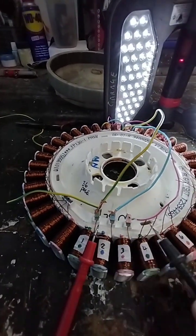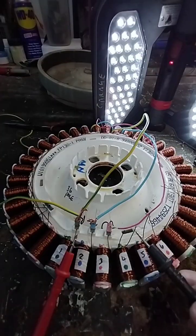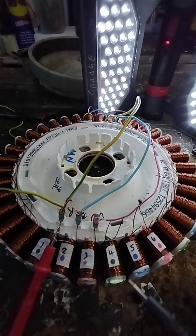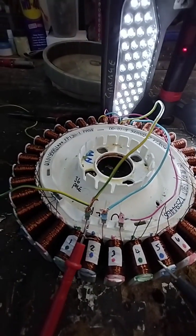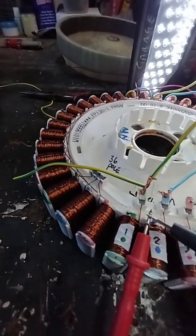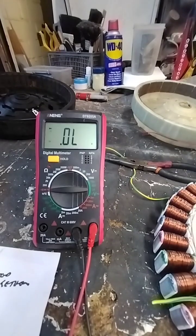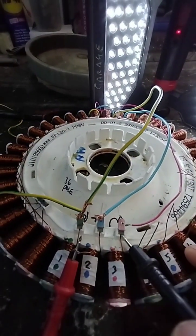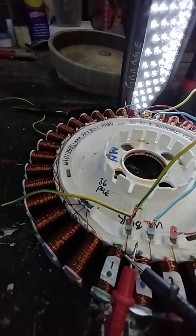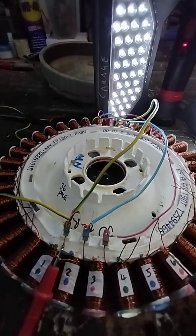The blue and the green confirm we've got a really good connection. You have to do that in all of the banks of three, because if any of these aren't joined together correctly you'll have a blank spot — that lot of three won't be doing anything. Make sure you do your continuity test. When you touch these two contactors together, it confirms continuity — electricity is flowing from this point to this point, and also to the join.